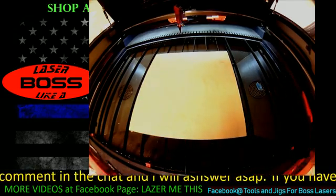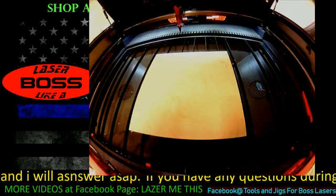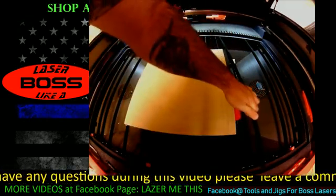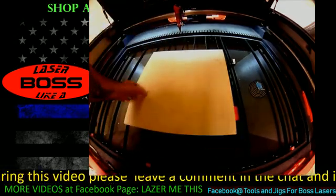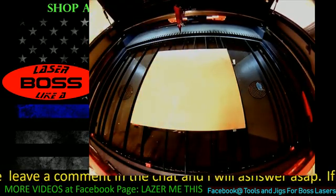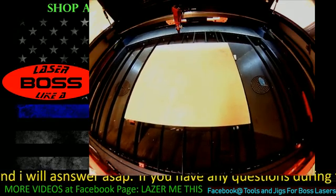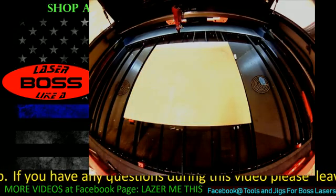Now take your blade clamps, get one that says back and one that says front, or one that says JER. All right. So this blade right here, I'm sorry, I had this backwards. This blade right here is just support. That's what you're going to be pinning your material to. The one next to it is the one that you actually want to anchor to. Let me move my head out of the way here. I've got to raise the bed. You want to make sure the bed's raised up when you're putting these clamps on, because if you don't, they won't fit on there properly and you can break them, damage them.